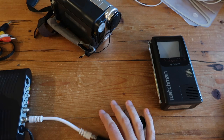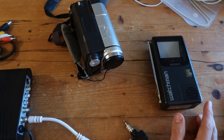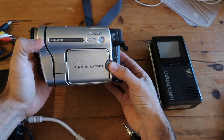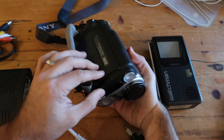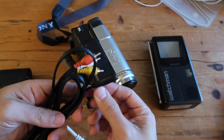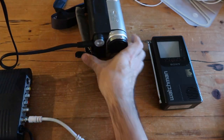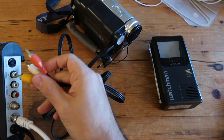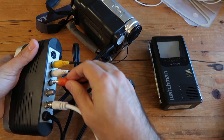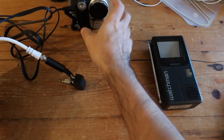For the input source, I'm going to be using a Sony Handycam Hi8 old camcorder, essentially because it has an audio-video signal output that you can easily use with this cable. You can use any kind of input source, such as a newer digital TV, but make sure that if you use a digital source, you'll have to convert the signal to analog first. In this case it's all analog, so I'll be connecting it using the RCA connections in the back of the RF modulator.